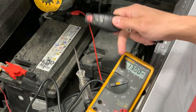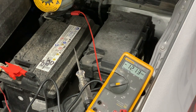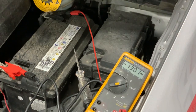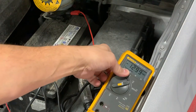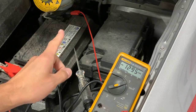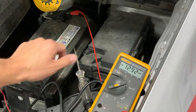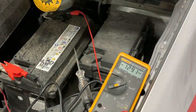What I'm going to do now is start the car — you'll watch it dip down. Now the 14 volts you saw is the alternator charging the battery. A good way to test the battery without using an actual load tester is to crank the engine three times. By the third time, if the voltage drops below 10 to about 9 or 8 volts, you've got a weak battery and it's not holding charge anymore.